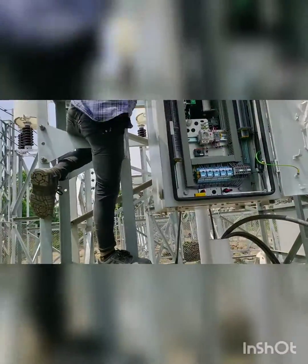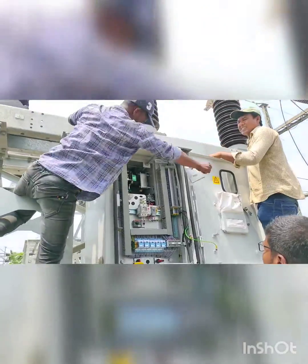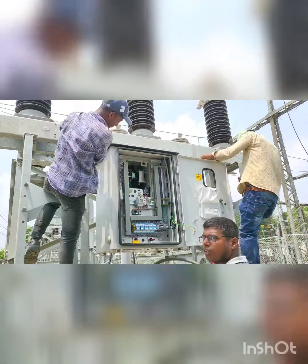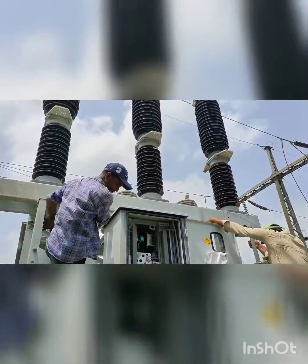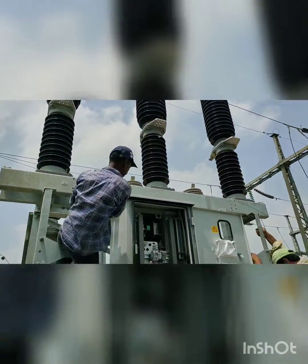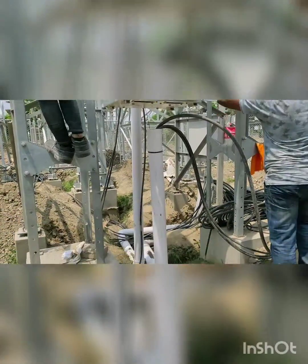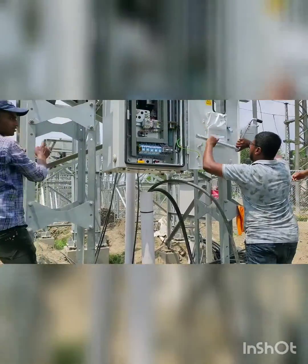You can see we are rotating the lever in a clockwise direction. Now you can see that the spring symbol has rotated and it is now showing that the spring is charged — you can know this by the symbol itself. This is the breaker structure base foundation.